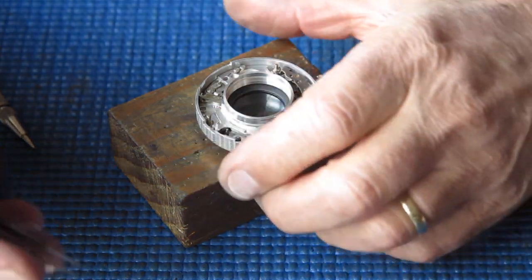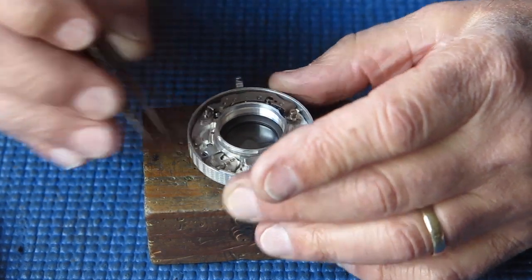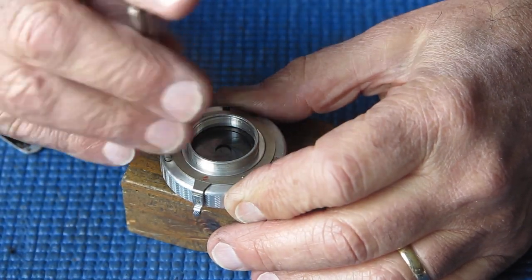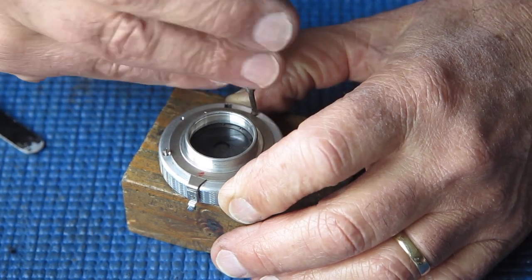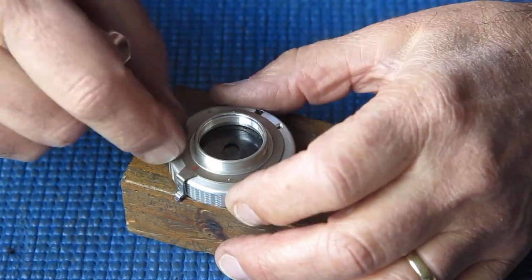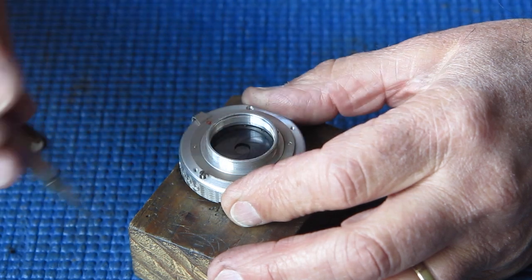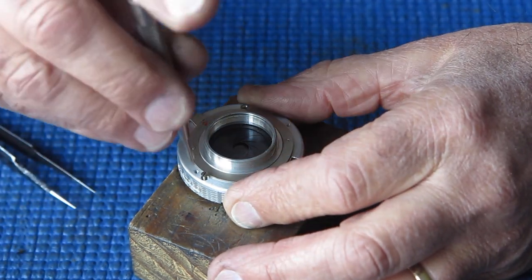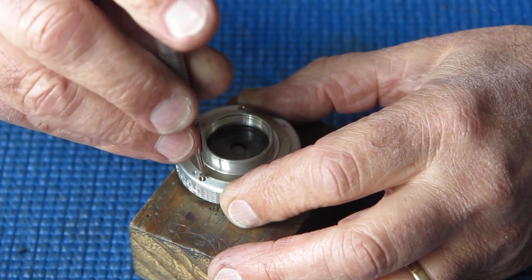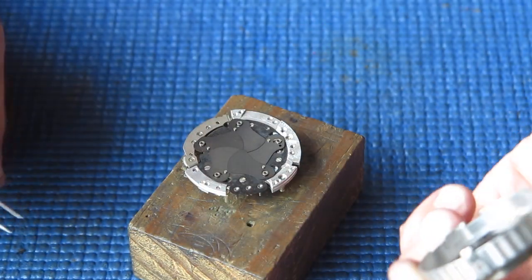I see them ruined fairly frequently. If they're damaged — cracked or split — that's not at all uncommon, but typically they'll still function. They don't have to be mechanically strong; they're an insulator, mostly just to bring the wire up to the contact. Sometimes they're fractured into a couple of pieces — you can always put them back with a little bit of nail varnish to stick the pieces together as you assemble them in place. So here's our mechanism plate and shutter case side by side.